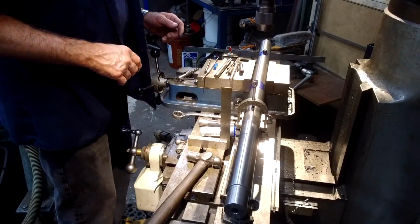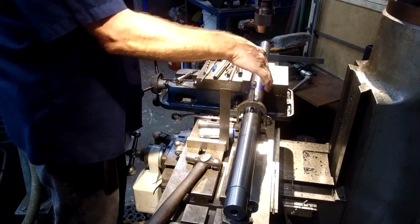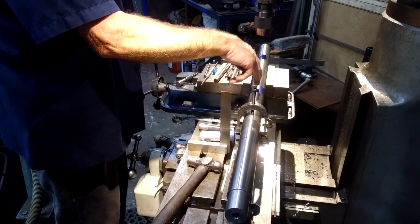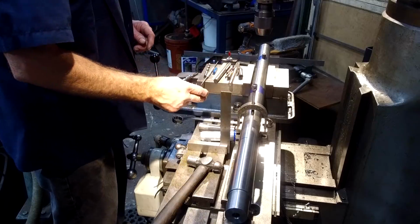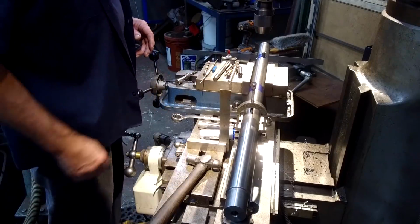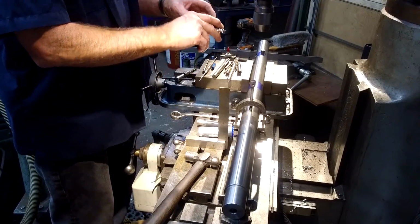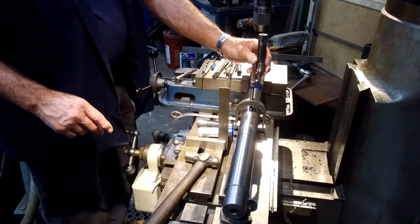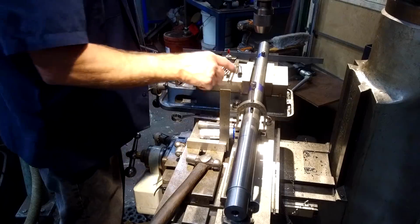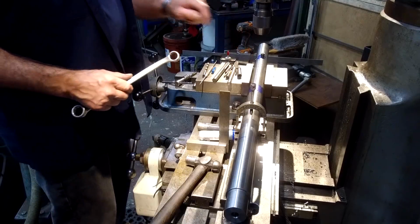Now we don't want to just come in and put a hole on a radius, especially when we're offside. If we're center of that, we can put a hole and not worry about it drifting off. But when you're rolling over the edge, your drill tends to lead off toward the downhill side of where you're locating it. So I'm going to set this up with a 4-fluted end mill, and we're going to come over and land a flat until I have the 1/2 inch flat in the location where we want the hole to go, so that we have a square surface to drill into.